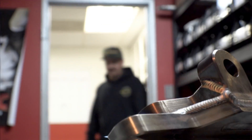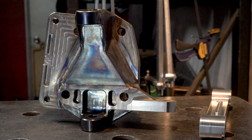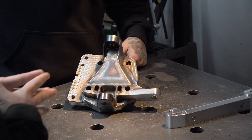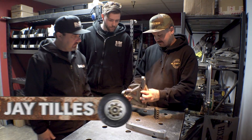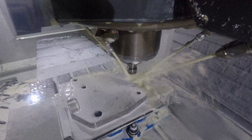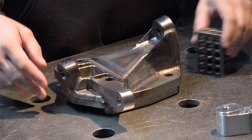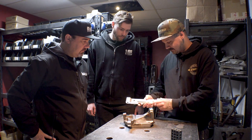Right there — that is jewelry! Take us through it. So basically, we started with this main block here, this main faceplate. Machined some keyways in it, then we machined the back side — two ops machined each side. Then we made these pieces that key into that faceplate. Lots of details in these. The caliper bracket came out super cool.